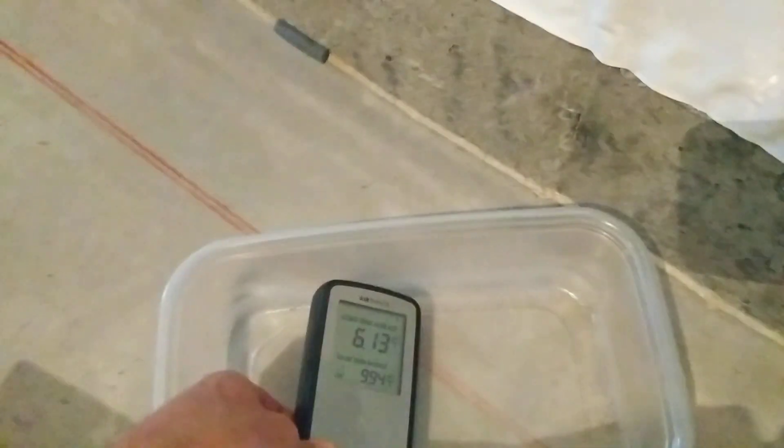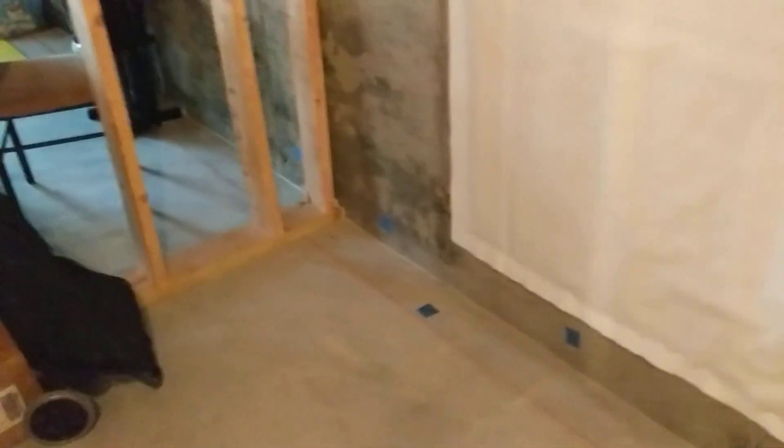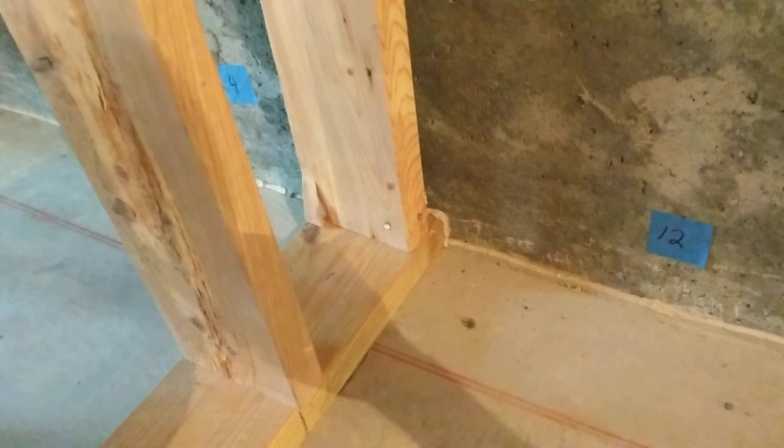What I've been able to find is a specific location in the basement that is emanating more radon than everywhere else. I'll do a 12-hour soak in each of these locations here, and I've written what the radon value was on a piece of painter's tape. You can see over here it drops down pretty dramatically — 3 being what it is just in the basement air in general.